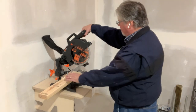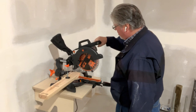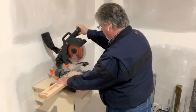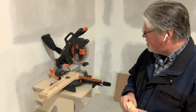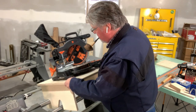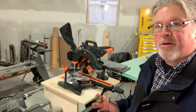Let's see how she cuts. There's a laser — I forgot about the laser! It cuts right on the laser. I'm hoping that's adjustable to one side or the other of the saw's kerf. A little bit of tear out here on the top with that stock 40-tooth blade. It's a 10-inch blade, five-eighths inch arbor, so it's standard.